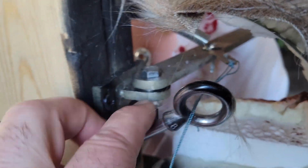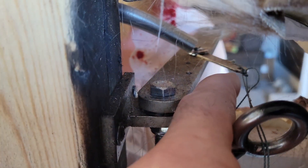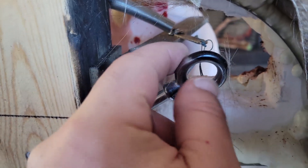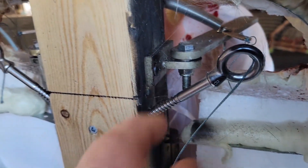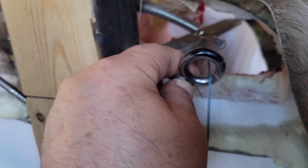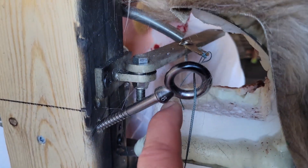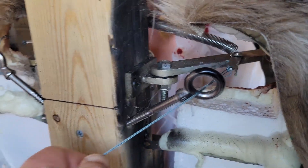I had a lot of problems with the arms coming out evenly, and there's a lot of stress on it. So what I did was I used a little piece of steel with a hole in it so there's not as much pull on it, and I just drilled it right to the arm with the spring. Then I put eye bolts so it would move more freely and not get tangled up. The eye bolt is a solid piece without a hook, so it slides out real smooth and moves freely.